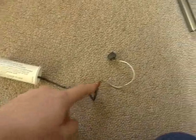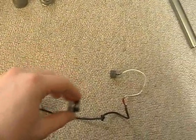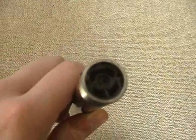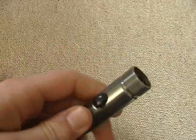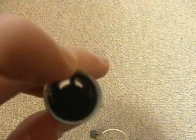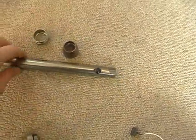What I'm going to do now is to desolder the microphone from the cable. Then I'm going to put the cable through — first I'll drill a hole into here, then the cable goes through there and up through this tube. Now you can see there are still some plastic parts left inside, but you can't take them out, because otherwise the switch will come out and then you have a stupid hole right here, which doesn't look very nice. So I'll leave that in there. The cable has to go through there — it's possible to get it through there. Then I'll solder the cable back to the microphone, and then I can put these parts on there, and it should be finished.